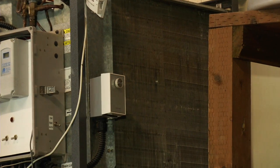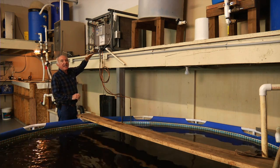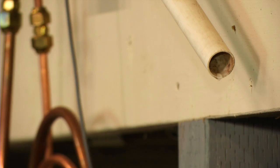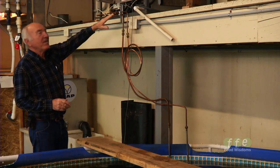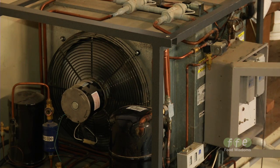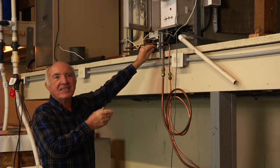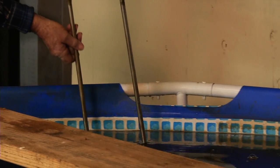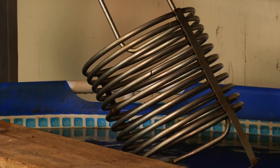The humid air comes in through this coil, which is refrigerated and cooler. It causes the air to condensate, just like an air conditioning system on your house. The water from the condensation runs down this pipe and is recovered. That heat then goes to my compressor and is compressed. I have a switching valve that directs where the heat will go. The compressed Freon can be as hot as 160 degrees, and I can put that heat into these tubes, which go into the water. This particular unit has stainless steel tubes in the water that transmit the heat.